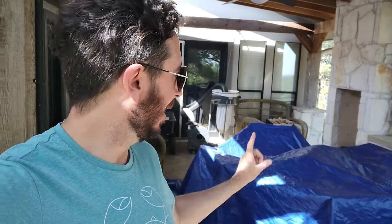Step one: insulating the garage. The first thing you want to do is pick the hottest day of the year, because that's seemingly when you're going to figure out that you need to do this. You need to make sure you've got some materials on hand. We're going to the store to pick up most of what we need, but one thing you do want to have is a pretty large tarp. You can gather everything, put it in the middle, and tarp it all over so you have access to the sidewalls. We're going to drill holes in the sidewalls, plug a tube down there, and fill it up with insulation. We're also going to go up in the attic and fill that in. I'll show you some of the prep work and give you the reasons why I'm doing this.